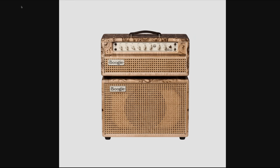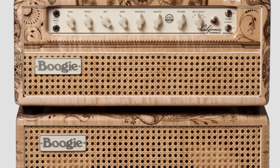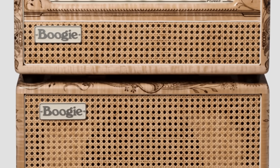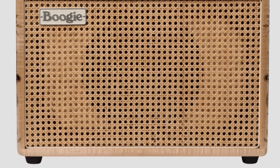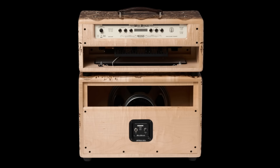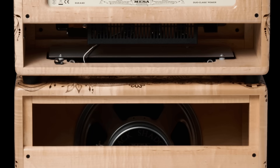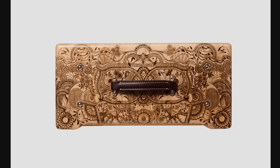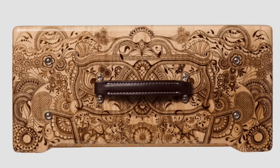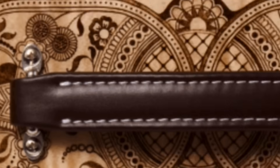Just like his previous release in the Master Artisan collection, this one comes bundled with a Mesa Boogie amp that has a similar designed pattern. This is the Boogie California Tweed amp. The grills are made of wicker cane, and it's a 6V6 power tube amp with 12AX7 and 12AT7 preamp tubes. It can be run at 2, 10, 20, 30, or 40 watts, running the Black Shadow Custom 90 12-inch speakers. It's been nitro lacquered to protect the designs. According to the Gibson Garage guys, there are some Easter eggs hidden within the design, so let me know if anything stands out.